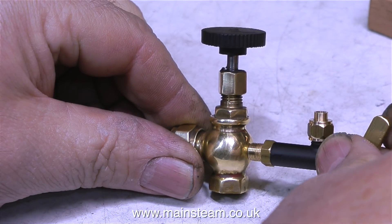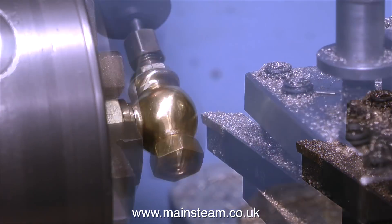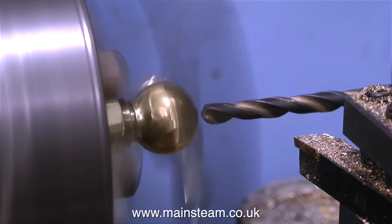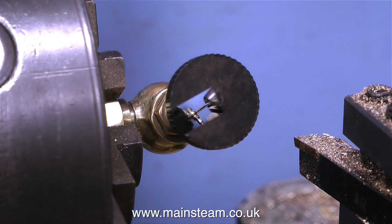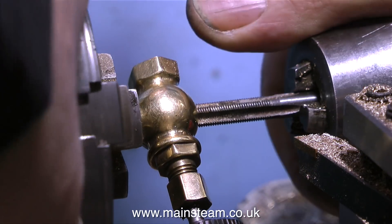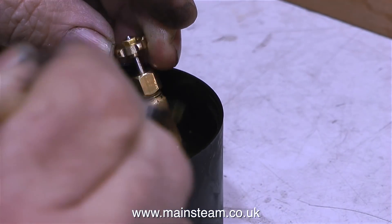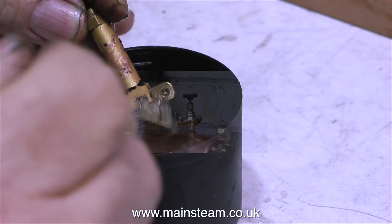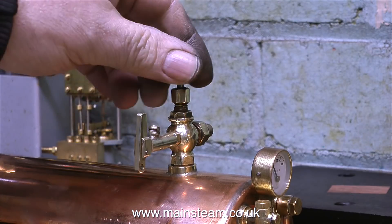I always find the steam tap on a 504 boiler to be a massive thing on top of the boiler that looks ugly, so I thought I'd modify it to mount the whistle. It's certainly big enough to allow me to drill a hole in the side of it to take the whistle valve. I've left the globe valve screwed into the nut because I didn't want to hold the threads in the chuck. After centre drilling it, machining a flat across it, drilling a 7/32nds of an inch diameter hole — which is tapping size for a quarter by 40 — I'm threading the hole quarter by 40 threads per inch. The steam valves and whistle valve have been in the cellulose thinners and the paint is just falling off. Once I've cleaned everything up, including the whistle valve, this is how it looks. By the time it's got the pipe on the other end it will balance up, and it looks much better than it did originally.